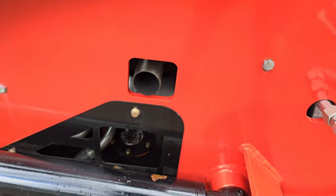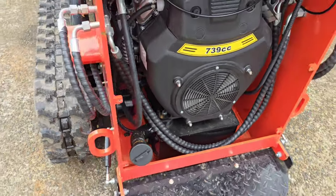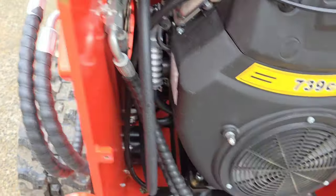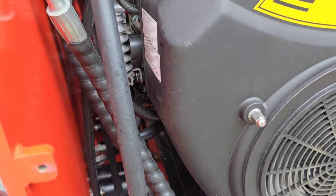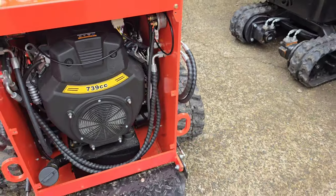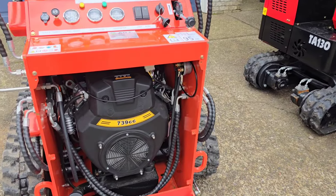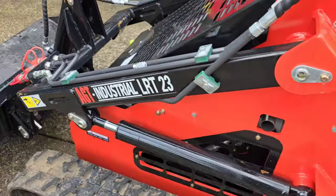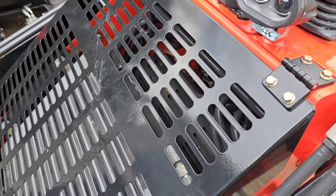There's your exhaust pipe coming out, and for filling it you've got your gas cap on the back. This also has an oil cooler on the side, and it does have an oil filter — right beneath that oil cooler. That's super important because these small excavators don't have an oil filter in the motor — it's an old-school Briggs & Stratton design. You want that oil filter in there because as you're breaking in the motor, you get metal chunks that flake off from the machining process, and you don't want that floating around the motor.